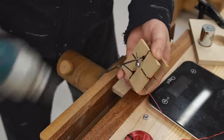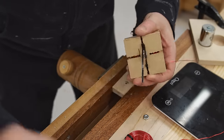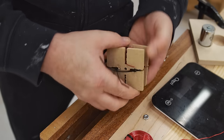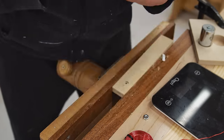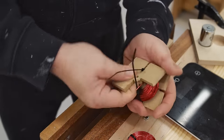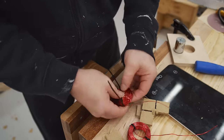And while I'm struggling with this, I'll talk a little bit more about what a crossover actually is. Basically, it divides the sound coming into the speaker into high and low and sends the high part of the signal to the tweeter and the low part to the woofer. And it does this by passing it through these combinations of inductors and capacitors. And specifically what I'm doing here is building what's known as a second order Linkwitz-Riley. And if you're interested in learning more about this, there's a link in the description to the build article with more detail.